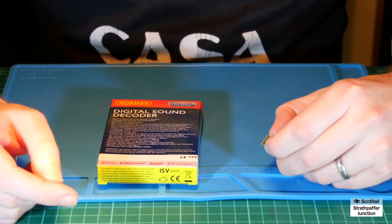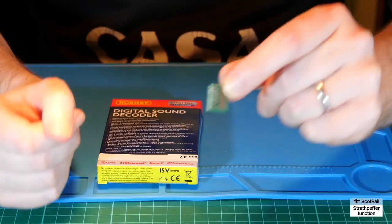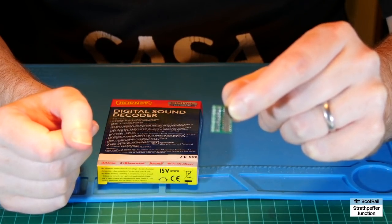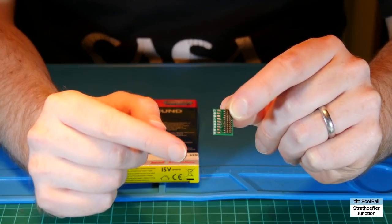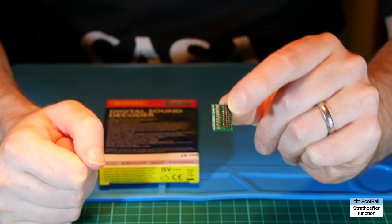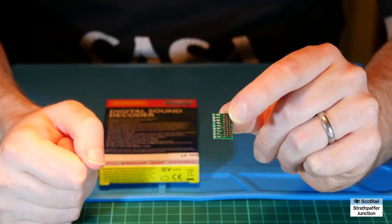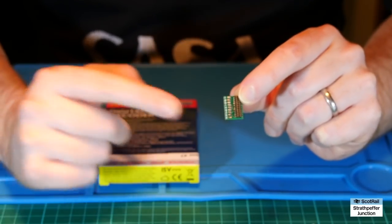Since I've done that, I've come across this little adapter here from TTS — these are 21-pin breakout adapters. They don't have the 8-pin sockets; there's no need to cut them off like I showed in the other video, and it makes the process of converting an 8-pin chip to 21-pin use really much simpler. So I'm just going to do a quick video on how to do that.